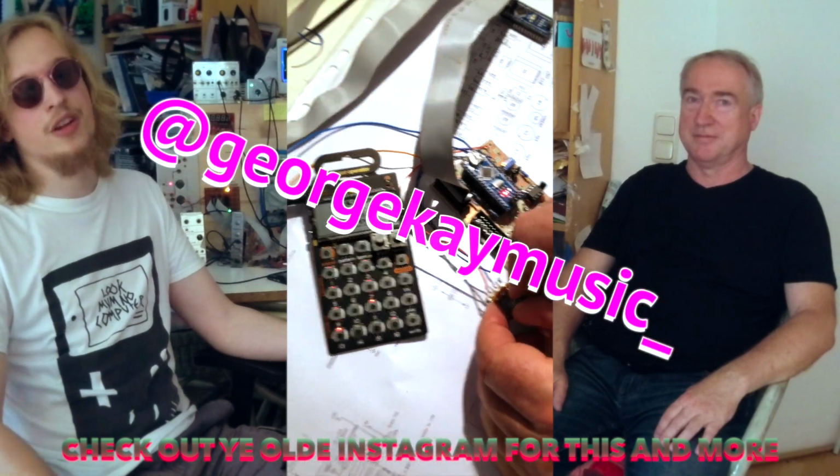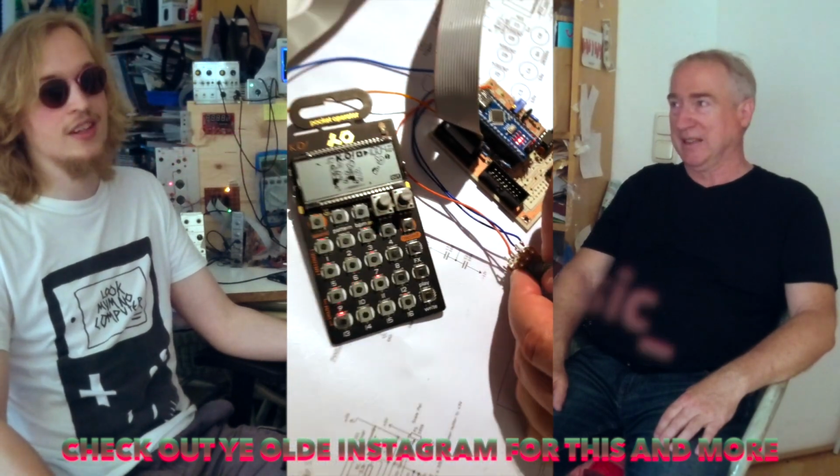I have this pocket operator 33, which is a tiny groovebox sampler, you know it. And you can sync multiples of these together via a pulse, but I don't have any others, I just have the one. And I wanted to work together with my circuit over MIDI, but it's not MIDI compatible. So we built a small little test rig with an Arduino that generates the 5-volt pulse that the pocket operator is synced to, and we actually managed to sync the pocket operator to an Arduino, so it will be a piece of cake to sync that to MIDI.